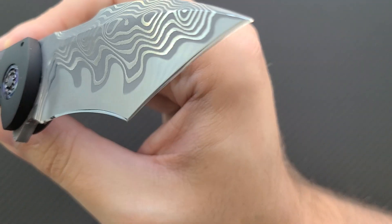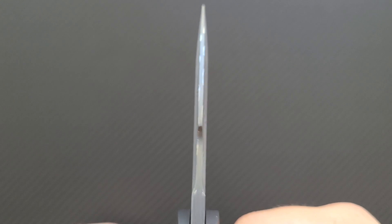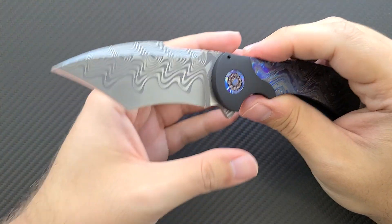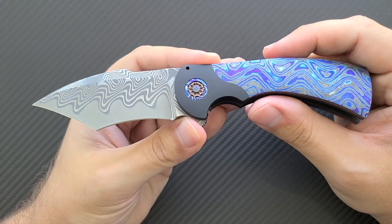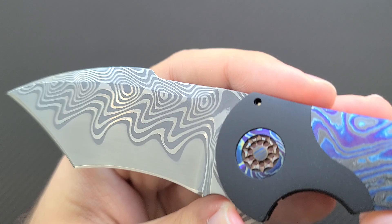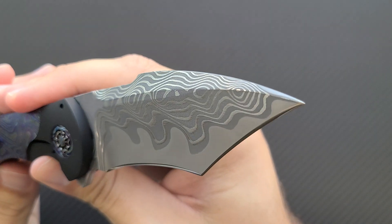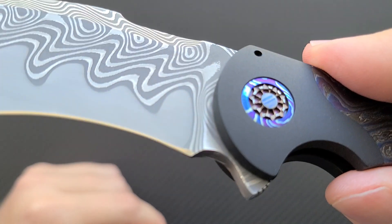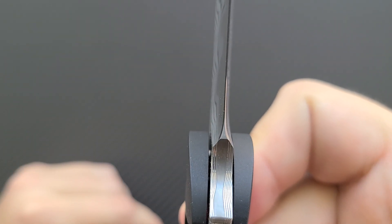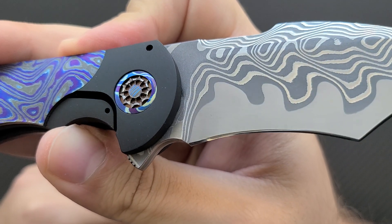I appreciate that this is a perfectly centered core. One of the risks of asking a knife maker to make a knife out of Sanmai is that a lot of Sanmai steels have a bit of irregular cores — they're not exactly straight. Mike Norris has recently come up with a solution where his cores are perfectly straight, though I don't really like that look either because it's almost too straight. This is a perfectly centered core though. I asked him — I said I really have to have that core centered, I'm so OCD about it — and he did a perfect job. I love how it tapers down like a waterfall towards the back of the grind, and the way he grinds the blade he leaves the heel in a bit of an artistic fashion, allowing the layers of the Damascus cladding to come down and form a beautiful edge.